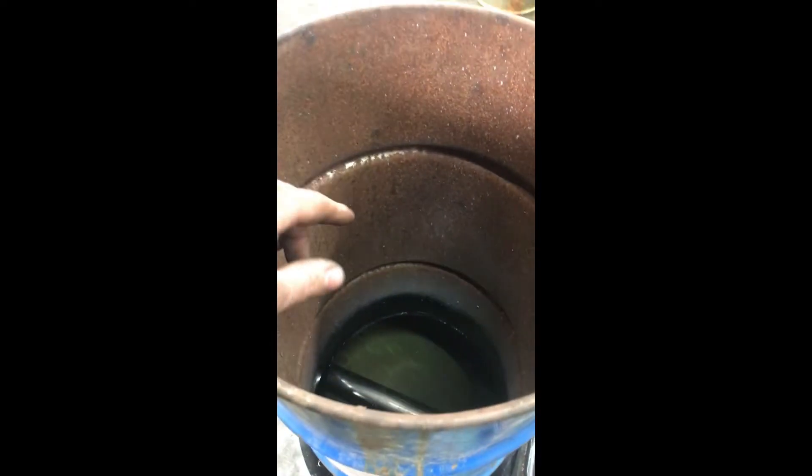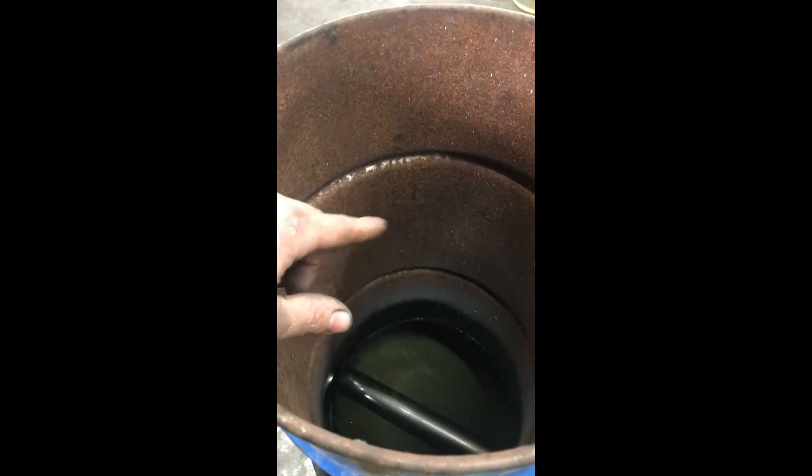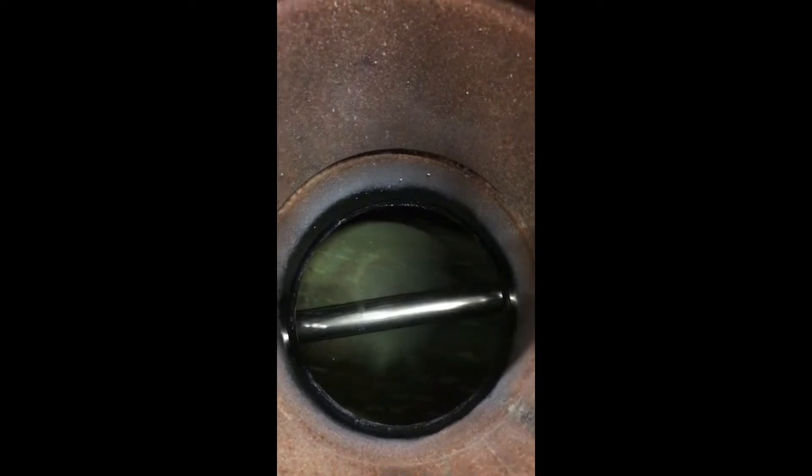So that's all done. Then I went ahead and blew out the bottom of it. I took my flat wheel and just ground down the outside edge until the entire floor of the drum came right out. So flushed it off, it's all done. And I have the start of my air inlet pipe sitting in there. Before I can start building the heat exchanger that goes inside of here, I need to figure out the length I need for that pipe, because that's going to mount the heat exchanger and also center it inside of this drum.